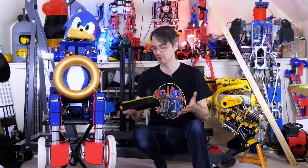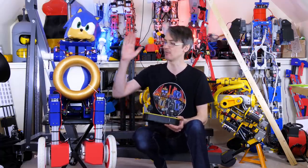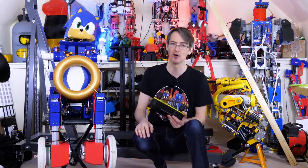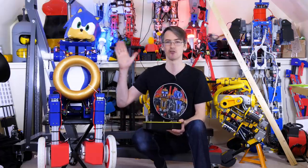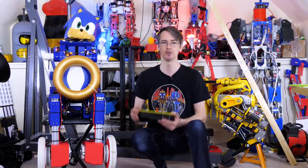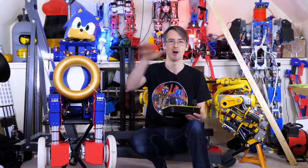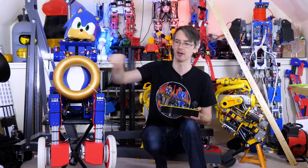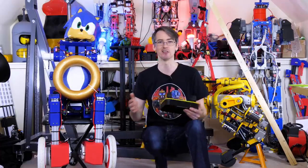One of those was my driving. The other one was that actually the motors can't go fast enough for the maximum angle I can achieve by pushing forward on the stick, which means it face plants quite a lot. So I need to have a look at the maximum speeds we've got on those motors and probably constrain that angle to several degrees less so it can't run away with itself. Also, the position hold doesn't work very well, so it does actually run away downhill, and that whole piece of land, you can't really tell in the video, is actually curved. So when you're running away from the middle, it tends to run downhill and run off with itself, which isn't very good, and I need to sort that out.